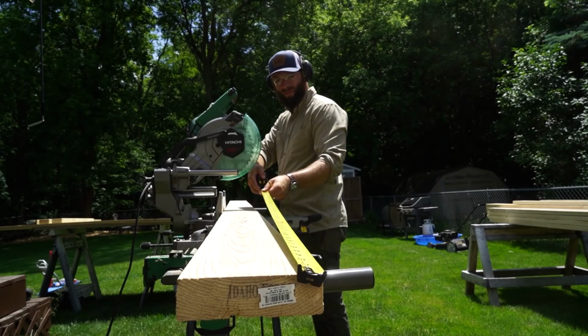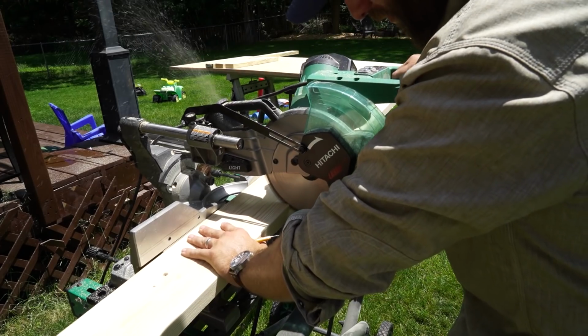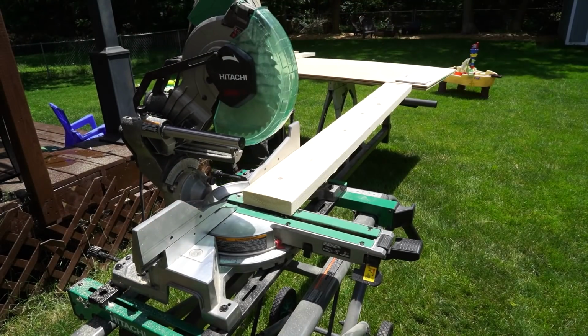The tops of the frames are made of 2x6s and the rest of the frames are 2x4s. I did this to give me an overhang on the top that will act as a drip edge, and that ended up working out really nicely.